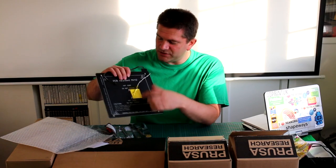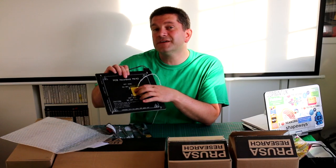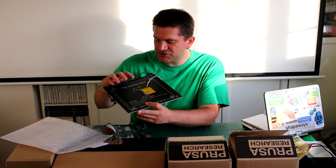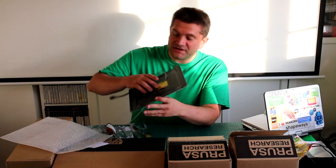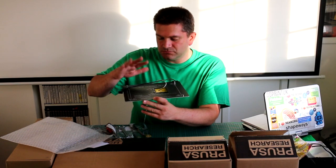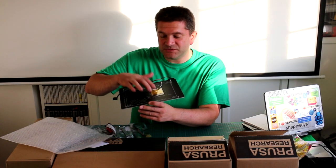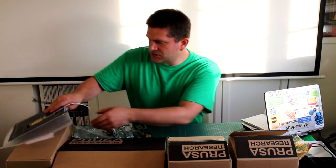The only thing I'm not quite so impressed with is the way the thermistor has been mounted on the back. It's got some aluminium tape and a bit of Kapton on it, and for me that's not quite good enough. I'm going to have to double check - maybe I'll peel this off or ask Joseph how it's actually been mounted. It may be fixed in some other way underneath, or soldered on. If it's just holding the wires in place and it's been soldered that's not so bad, but if it's just being stuck down as a surface fit I may have to adjust that.